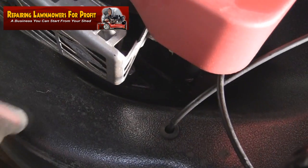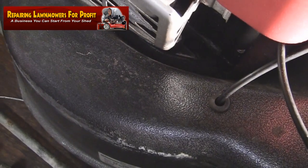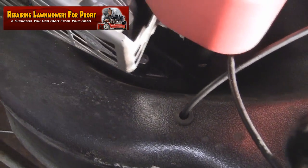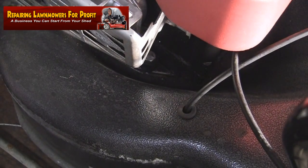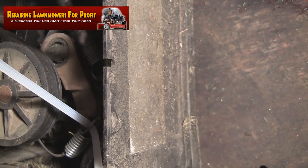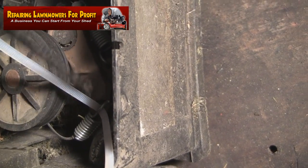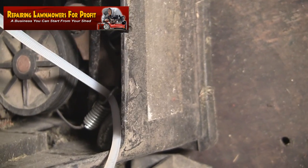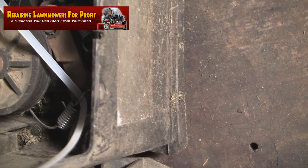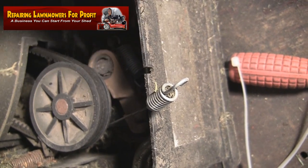If you're having trouble with the tension trying to get it off, try pushing the cable back into the mower deck a bit more — that will actually help you get it off more easily. Sometimes if it's pulling up it can make the spring tighter than it needs to be. Get yourself a cable tie and push down on the cable and eventually it will come loose. If you still have difficulty, take a flathead screwdriver around the back and pull it off — working with the screwdriver and the cable tie together. It took me a couple of minutes in the end.